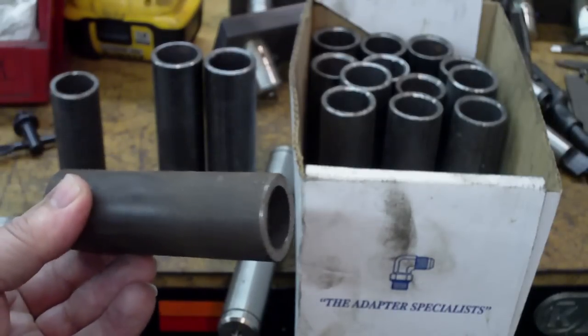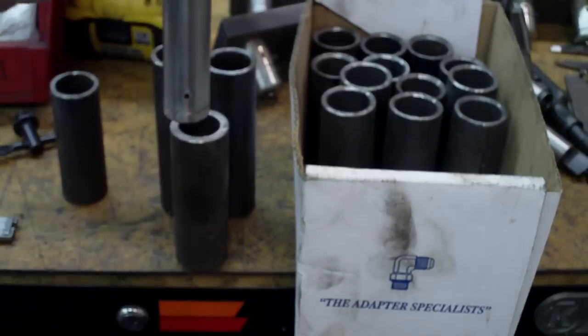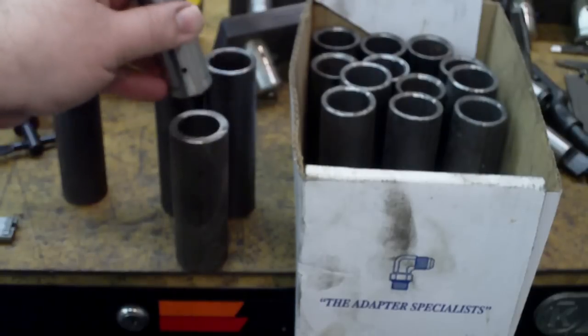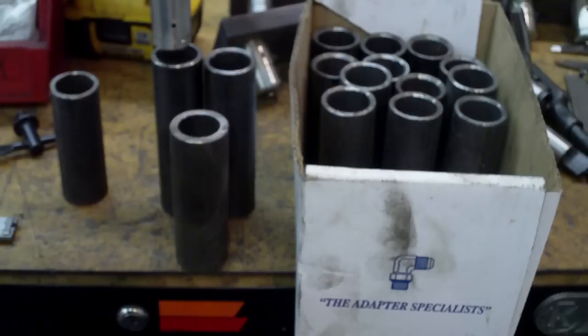There's no need for this for what we do — this is scrap as far as I'm concerned. You can't get a one-inch piece of stainless steel to go through it with a chamfer on it or anything; you have to bore it out. No way. So we use schedule 40. This is one without a chamfer on it — it has a little clearance in there, so you've got plenty of room to go in there. But your problem comes in if you're misaligned: if you're under the truck or in the bed of the truck, however you want to put it in there, if you're misaligned by over a sixteenth of an inch, you're going to need a hammer and it's not going to go in there.